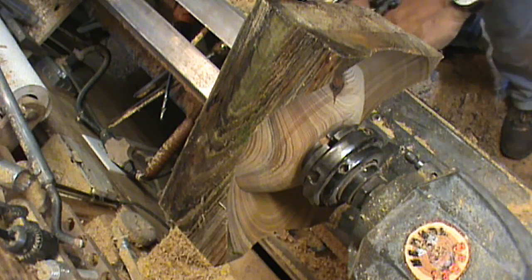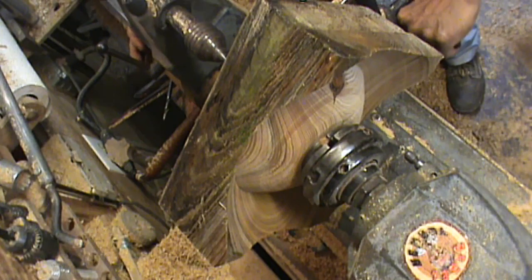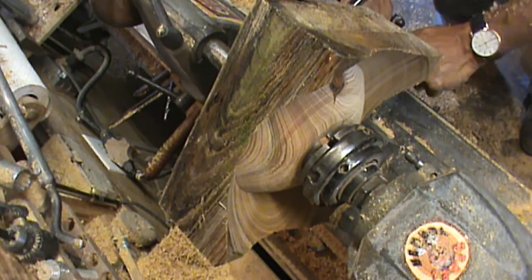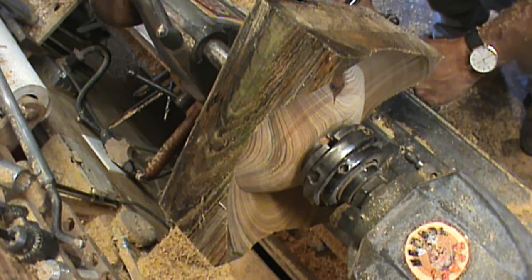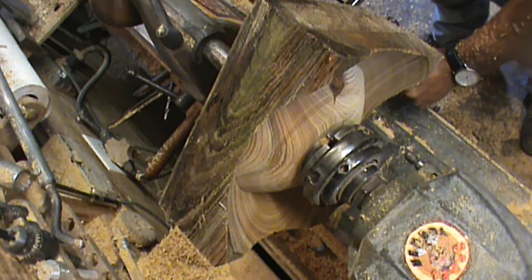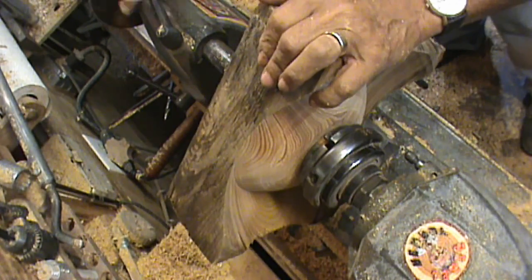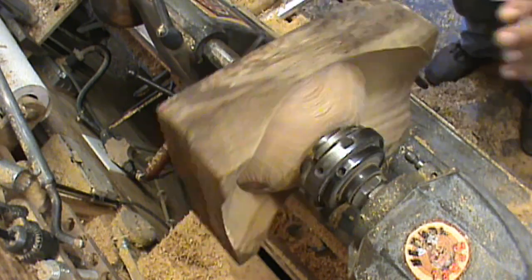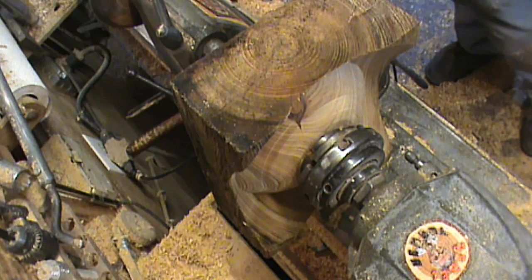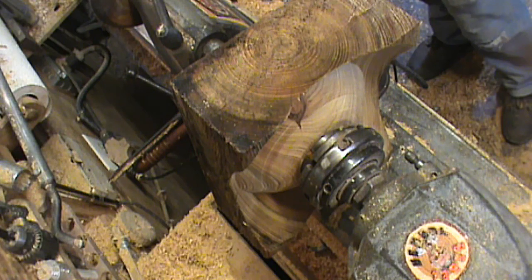But again, just like before, live center in. I'm just not that brave, I guess. I insist on working with a live center all the time, but why not? It's a safety feature that you should be using all the time until you get to the point that you have no choice but to get it out. But when you have a choice, pretty good, yeah.